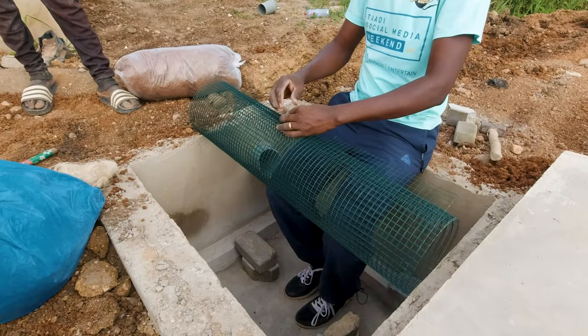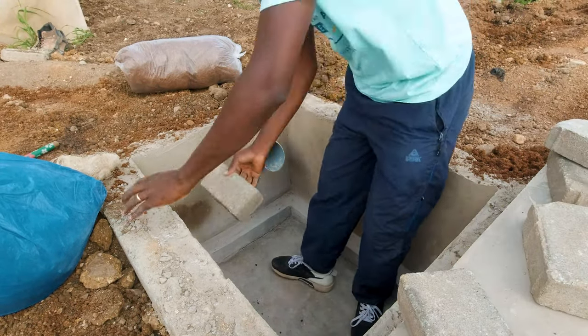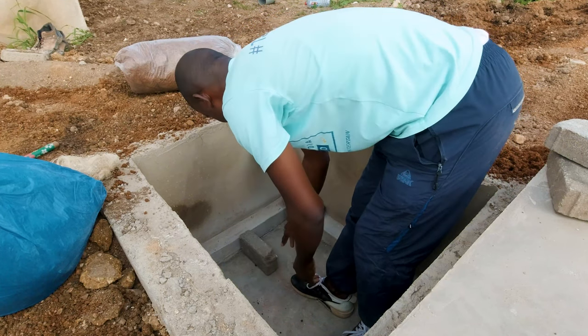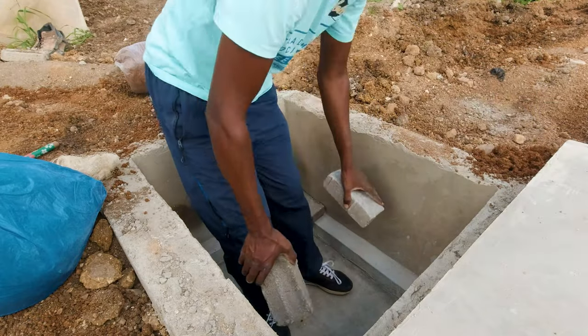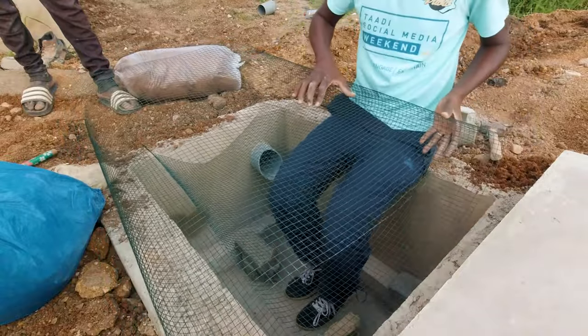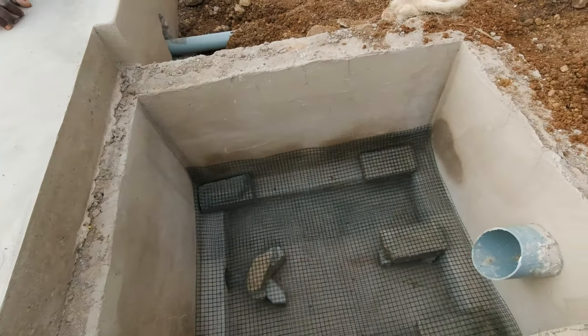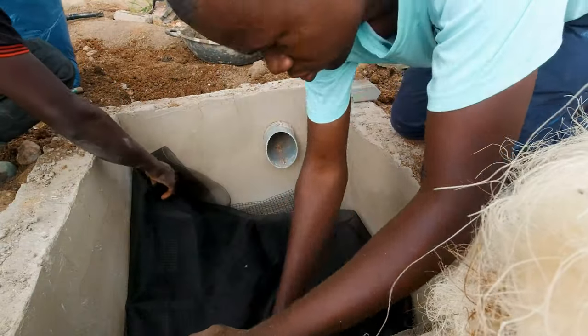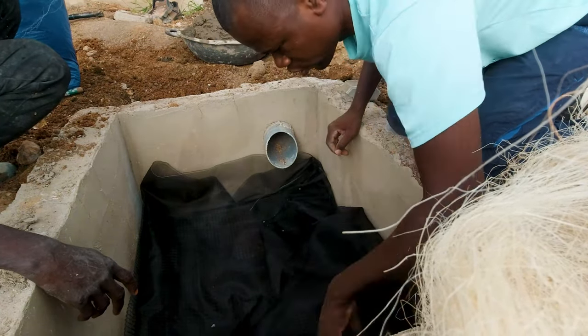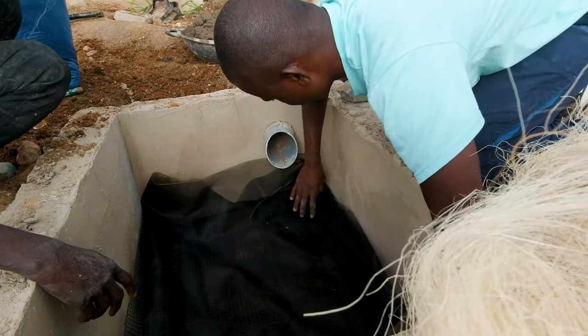One of those materials is a fiber net as well as a coated mesh which you place on top. During the biodigester installation, we made good use of the step. We needed to raise it a little bit, so we used some design blocks to raise the platform and placed some in the middle to prevent it from sinking. The first layer of material placed in was the coated mesh — we bought two yards and folded it so it becomes a bit stronger. Then the next material is the fiber net, placed on top to prevent solids from passing through — only liquid should be dropping in and going to the soak away pit.